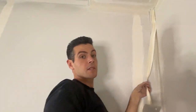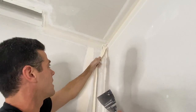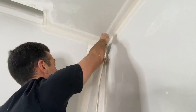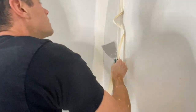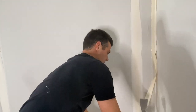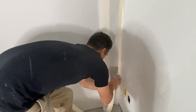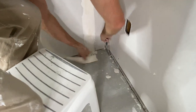If you're overlapping a bunch of tapes at the same time, what I often do is take the tape a little bit back, get some mud on it, and put it up in the corner like so — so there's actually mud there. It's about a quarter inch down. The tape stretches so it's not a bad idea to give it a quarter inch as you roll it. Pull the tape right here and get it nicely tucked in the corner.